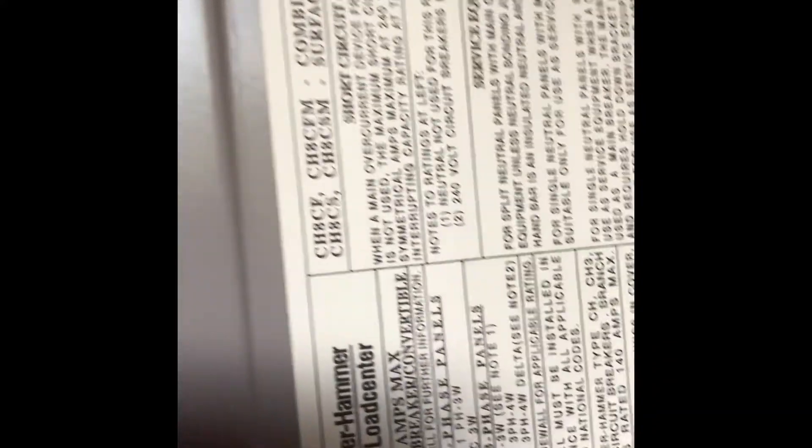That should be everything inside here. The next video will be of the breaker panel. It's a Cutler Hammer load center. Everything is clearly marked — we have a double 30-amp breaker there on the top. There is a ground wire coming out of here that is bonding something, but I'm not sure what it's bonding.